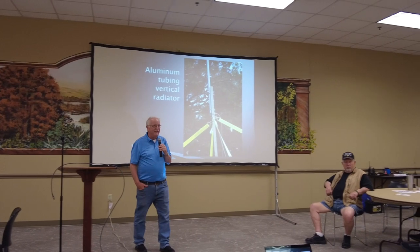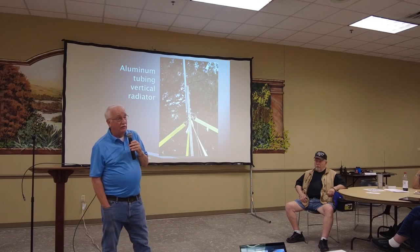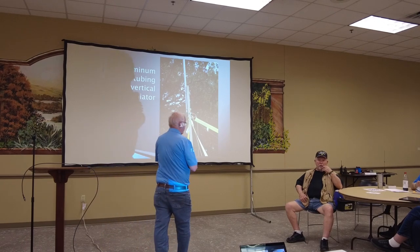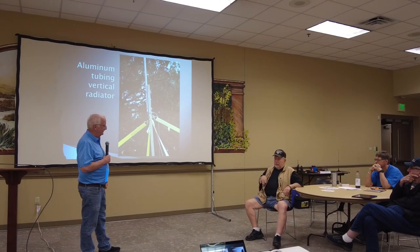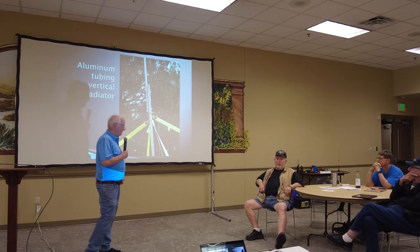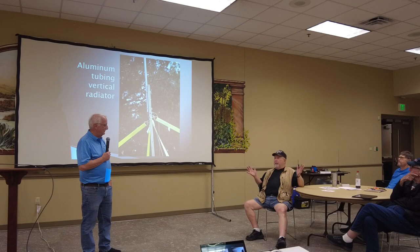Question: How far away were your contacts? They worked all over the country. On another Field Day using a 20-meter vertical, back-to-back contacts included the Virgin Islands and then Hawaii — fantastic performance. Someone else noted working 20 and 15 meters well on a 50-foot fiberglass vertical running all bands on Field Day. When you got on frequency and started calling CQ, in no time at all you had a lot of people responding — it was working very effectively.